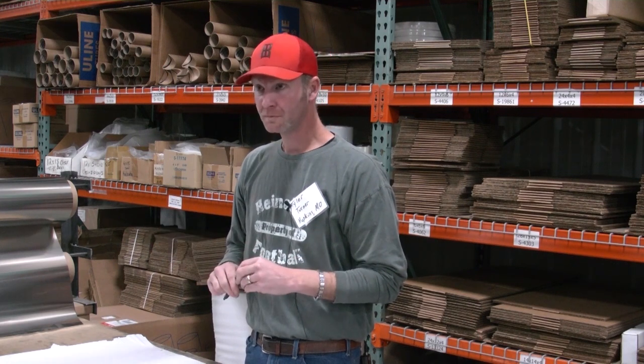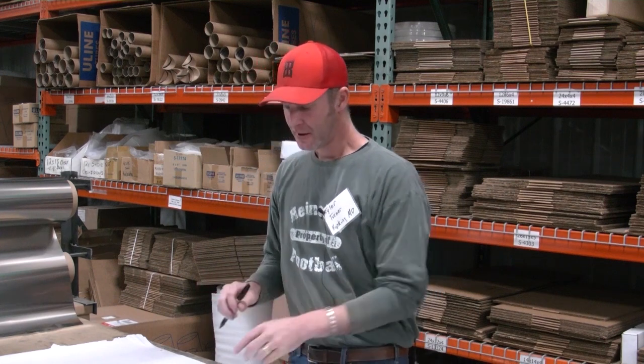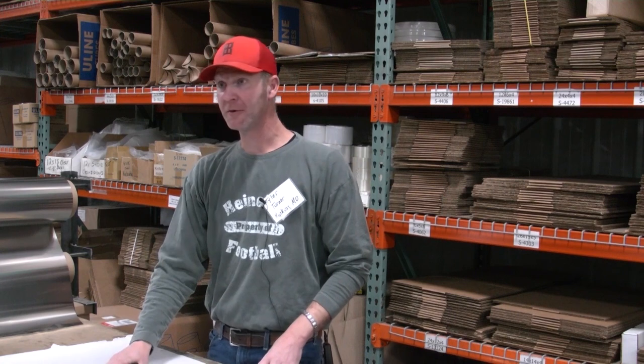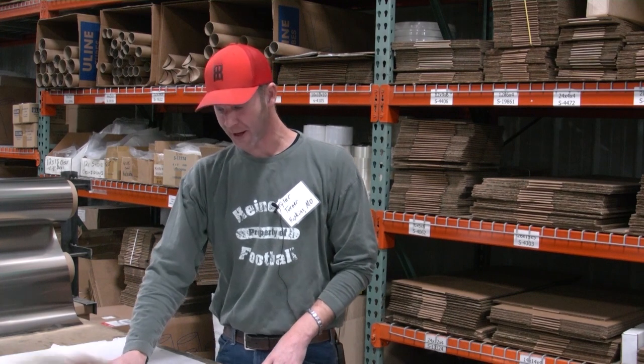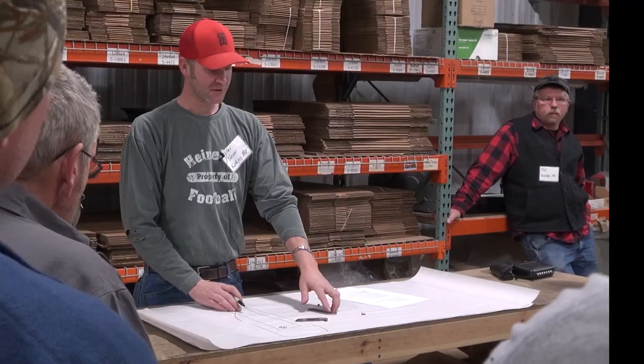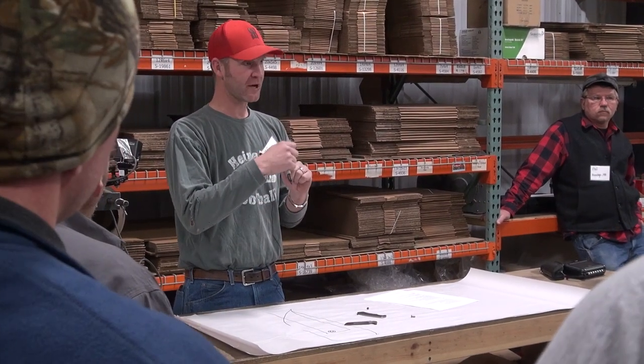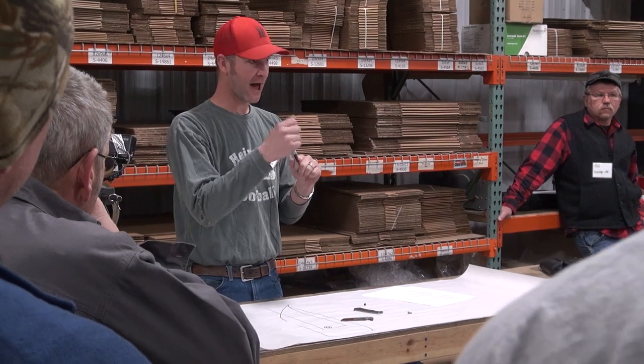That's what I use, because the blade's hard now. Yep, because the blade's hard now already. So drill through that, and then you've got that established. Then now it's time to drill your hole in your knife blade. You assemble it with your gauge pin, close it, tighten it all the way up, fully tighten to where you cannot move that blade out at all.